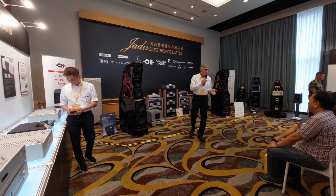It is, like everything in the 10 series, based on a two chassis design. So you have the phono stage, and then you have the power supply off to the side, and it can be expanded to dual mono or full four box. If you have more than four inputs, you can also double up the inputs and have a total of eight, only in the dual mono mode, of course, at that point.